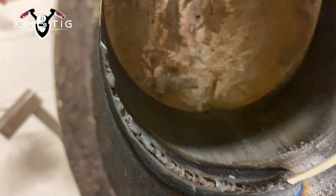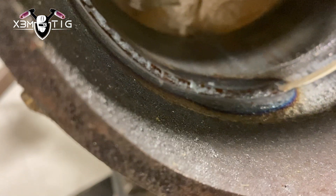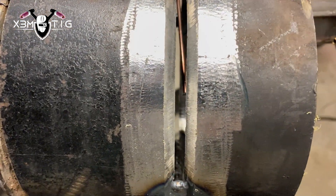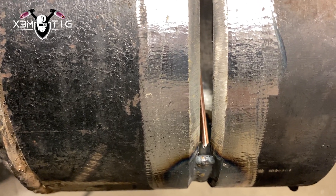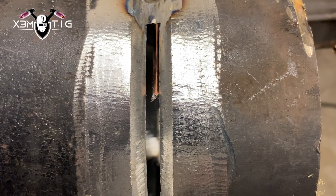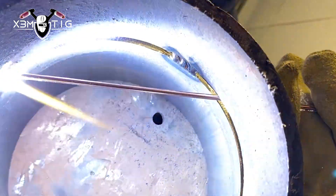This is the first section we did at the bottom quarter. Now I'm going to continue up on the same side all the way up to 12 o'clock. This is another challenge — and that's one of the reasons I did the back feed technique for the entire pipe. Usually it's just for the bottom quarter, especially in the field, where you want that nice buildup to prevent any suck back.